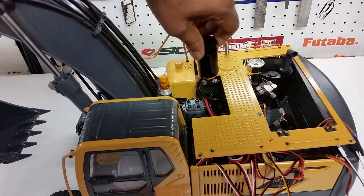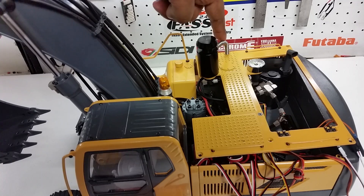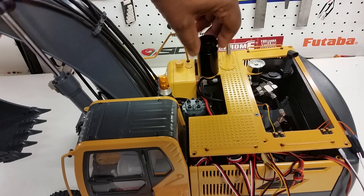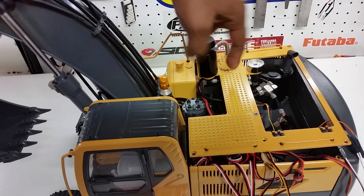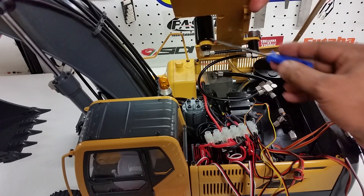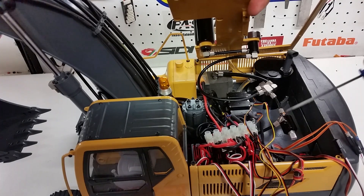The hose is then connected to a pressure regulating valve up here, which also acts as a relief valve. It looks like an air filter cosmetically, but it's actually a pressure regulating relief valve. You can rotate it to increase or decrease the pressure — by unwinding this valve, you're letting excess oil pass through an orifice on the inside back into the tank. If you shut it down, you prevent that bypass, forcing the pump output into your valve blocks.